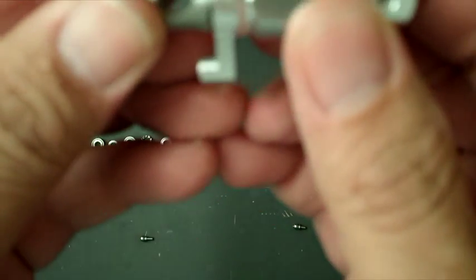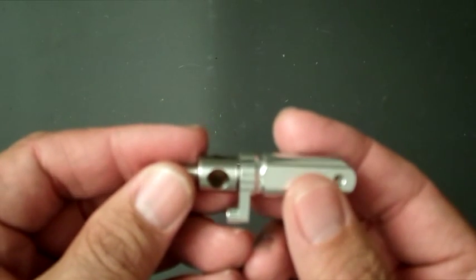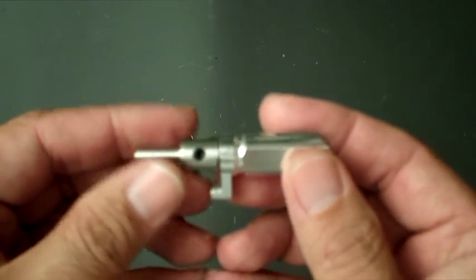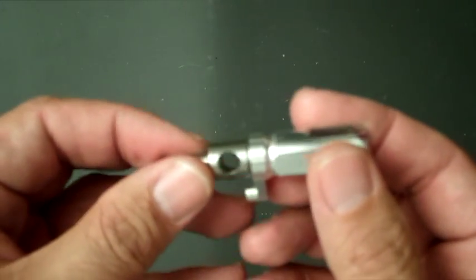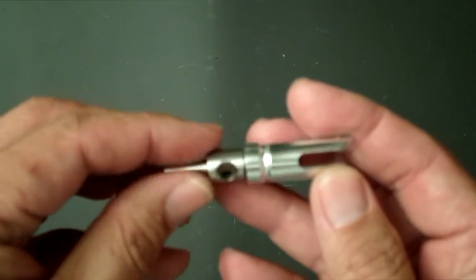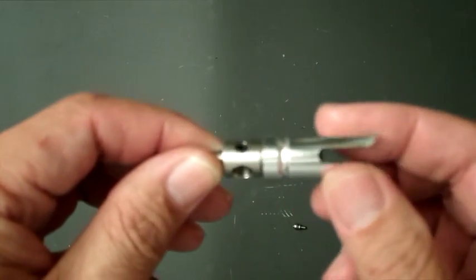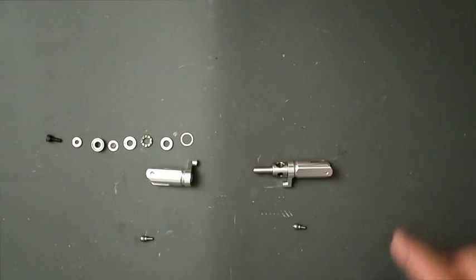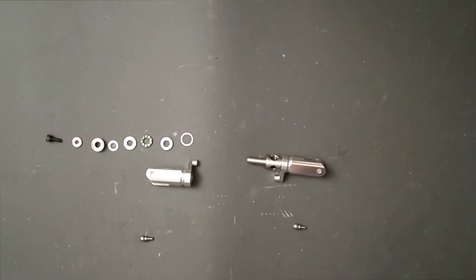Once you get everything in, this movement is there by design. I saw a lot of people on the forum asking why there's play on the grips. That is there by design, and from what I understand from an explanation by James Haley, the designer of this helicopter, it enables the thrust bearings to actually do their work properly, without pressure from being squeezed in. He said this also helps prevent those weird vibrations sometimes people run into with the tail. After flying my first 700X, I'm telling you, this is one of the smoothest tails you will probably ever build. Very well designed. So just to say it again, this movement is there by design. So this side's done. I'll put that ball right there, and I'll go ahead and finish the other grip and bolt the tail case and the sliders all together.